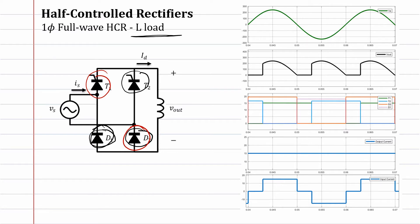We can use only one thyristor — the other thyristor can be replaced with a diode. The diode will turn on automatically if the voltage applied on it is positive. So here we can keep resources, use diodes and save thyristors. At this point, thyristor one receives the signal at firing angle alpha.